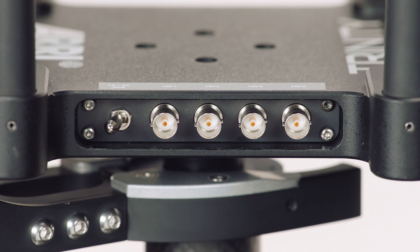Now let me walk you through the single components included in the Trinity Live upgrade. On the left side, we added 4 BNC sockets for video in. This allows you to run the system in 4x3G or 2x6G — two in the end — to get 12G out of the camera, which depends on the camera and the setup of your video transmission.